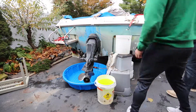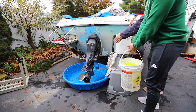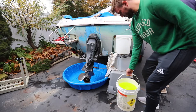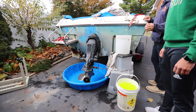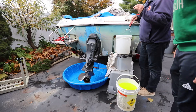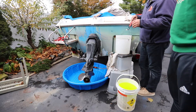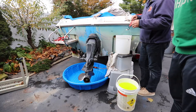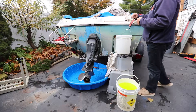We've got our bucket of antifreeze ready to go. This bucket is going to be poured into the feed bucket, which will then flow into the engine. Prior to this whole winterization process, the recommendation is to have your engine running using fresh water — run it for 10 to 15 minutes — and make sure your gas has been stabilized with products to stabilize the gas for winter storage. Then you'll be ready to winterize the engine by pouring the antifreeze in.